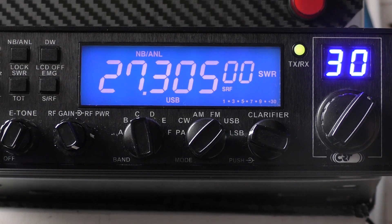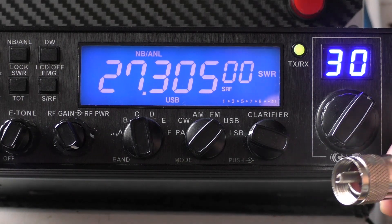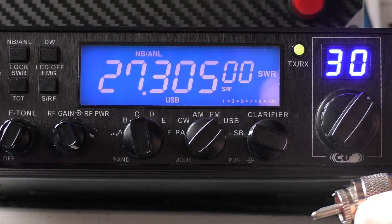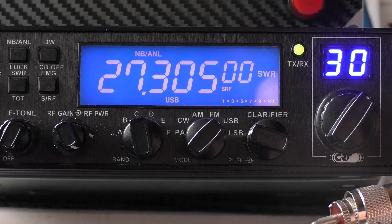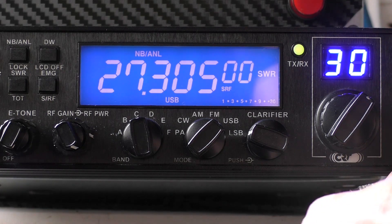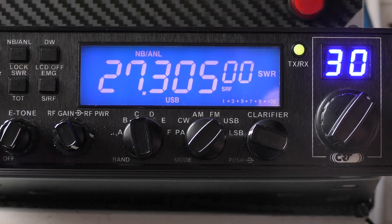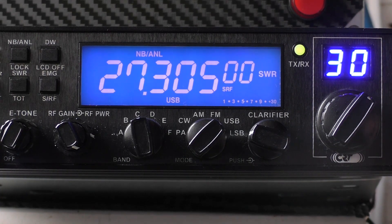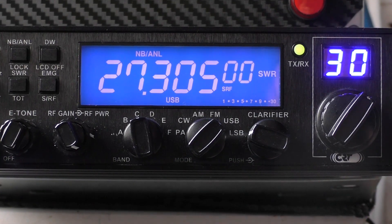Check the basics - check your line to the antenna. A simple way is to get a multimeter and do a continuity test from the centre pin to the outside edge with the cable disconnected from the antenna - you should not get a contact. If you get a continuity beep when testing the two sides, you've got a problem. If you haven't got a continuity tester, google 'simple testing meter' and it will show you how to build one with a battery and a bulb. Basically, you don't want any continuity on that lead at all.